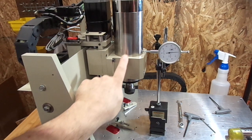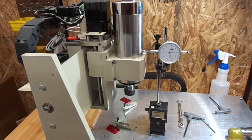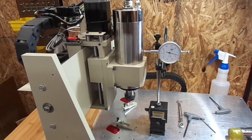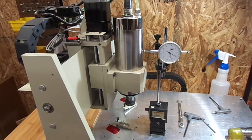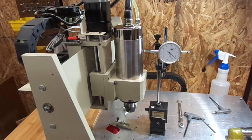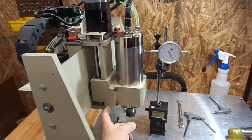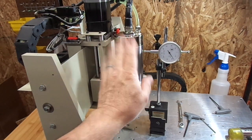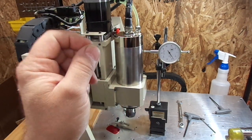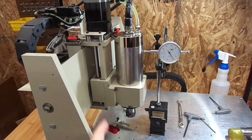I need to do this one first because I need to put shims under here. Our spindle is sitting tilted this way, so we need to put some shims under the bottom to kick it out. I'm going to take either some notebook paper or the back side of that two-sided tape and stick it here as a shim. I'll bring you back when it's all done.